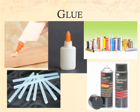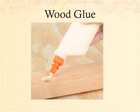Glue is an adhesive — not really a hardware or fastener, but it glues stuff together and is used a lot in scenery. Wood glue is designed to glue wood together with a special blend that works really well with wood fiber. With all adhesives, it needs a lot of surface area to get a strong bond. When you squirt it on the material, you spread it around with your finger, a spreader, or a putty knife to get a nice thin layer over the entire surface of the two things you're gluing together. It also likes a lot of pressure — the thinner the layer between the two pieces, the stronger the bond.